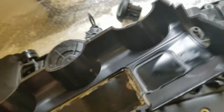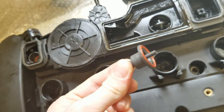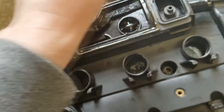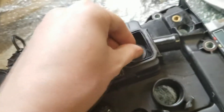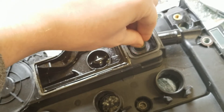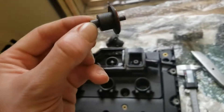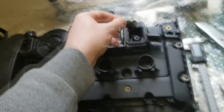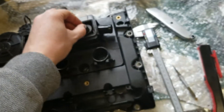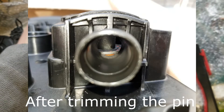Pull the cover off gently and carefully, pull this out, shorten that by about two and a half to three millimeters, and pop it back in. You can tell it's sealed because when you turn it with a little bit of pressure, you can feel it's quite tight and grippy — whereas before it was just spinning freely. The amount I had to shorten it by was exactly three millimeters on mine. But don't go too far, because that pin is there to keep it central.